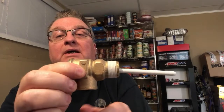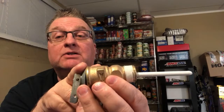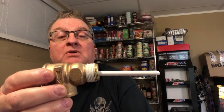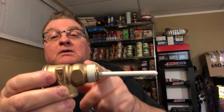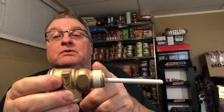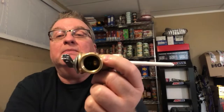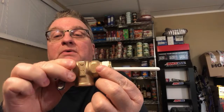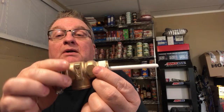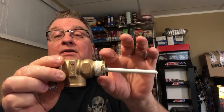What I'm going to recommend is when you're putting any fittings together — whether they're water or gas, should you feel confident and educated enough to plumb gas lines in your trailer or RV — tape and dope. My industry, oil field, pipe fitters — some of the best journeyman pipe fitters taught me that. Tape gives you the lubrication to get it in, and then dope it with a PTFE, which is a liquid Teflon. You don't want it to go in and get tight while it's aiming the wrong direction instead of straight down. If you use tape and dope, you have the ability to stop — it's just getting good and snug — you don't want to strip your threads, and you get to the straight down position. See the arrow? Straight down. Now you can just stop, and the tape and the dope you put on there is going to be your sealant.